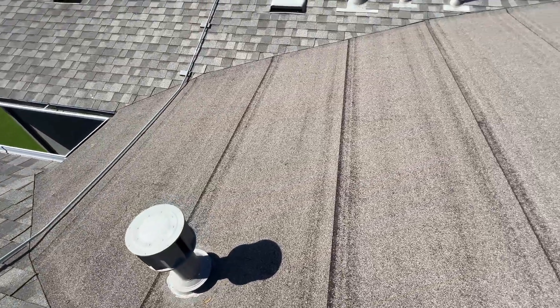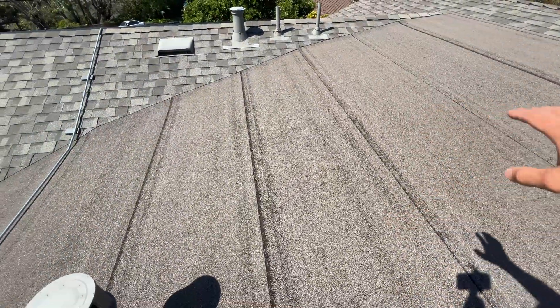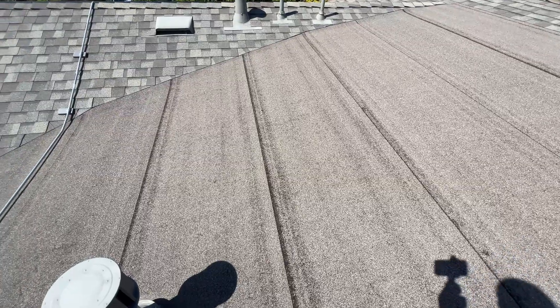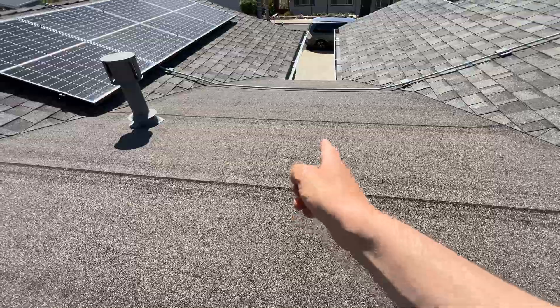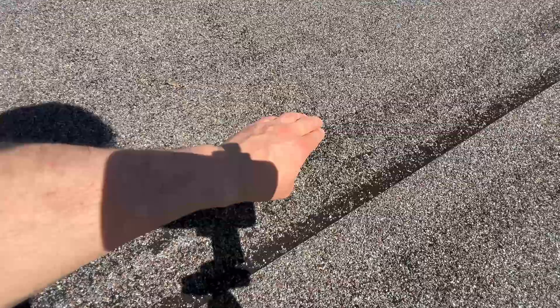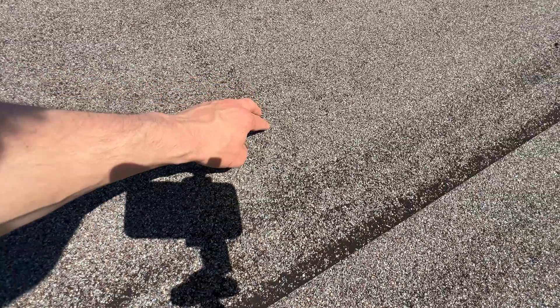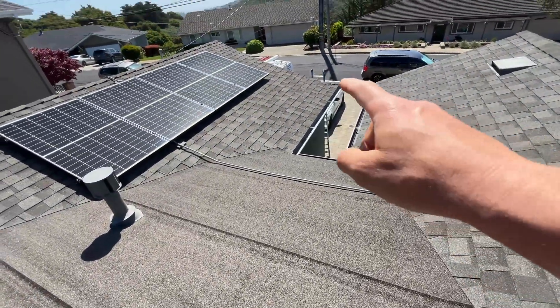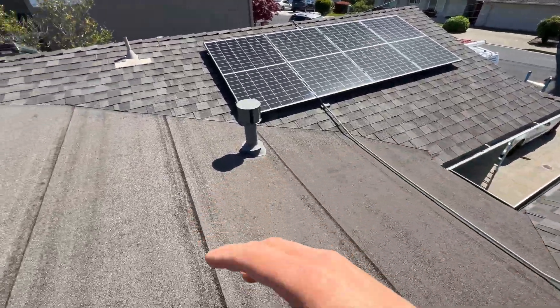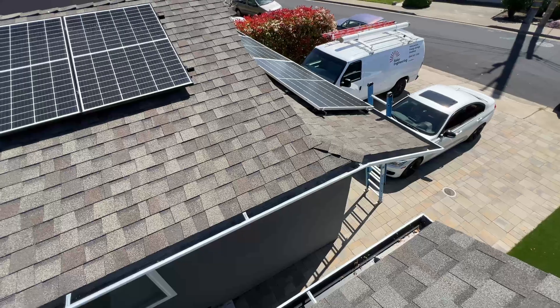Area number five is hard to show — you have to feel it. On this part of the roof we have four-by-eight-foot plywoods and somewhere they're going to meet each other, and that area is going to be unstable with some movement. Whenever you're walking on the roof you're going to feel these areas. We can see the line going somewhere here. When two pieces of plywood move it adds stress on the material. Whenever installing solar panels, if you feel areas like that just memorize them and avoid them.